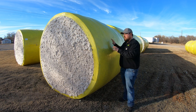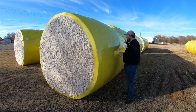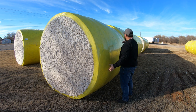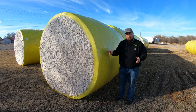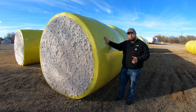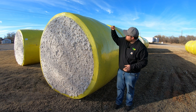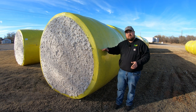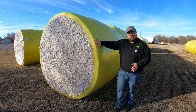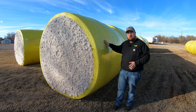On the yellow and pink, there is an adhesive strip that goes all the way down the length of the plastic wrap — from one edge all the way around to the other edge of the bale. The length of adhesive that goes around a pink or yellow wrap is 35 feet, meaning you have adhesive all the way around the bale with a little extra for the next wrap, since each module gets just over two wraps.